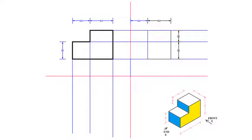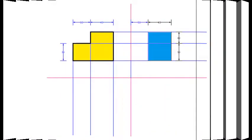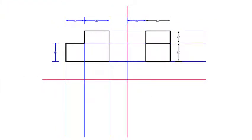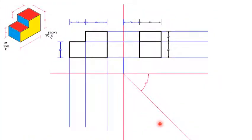We move on to the plan. To draw the plan, we shall need a deflection line of 45 degrees, so that all the projection lines hitting that deflection line will be deflected at 90 degrees and therefore transfer the measurements we have here. Draw that 45-degree line and project these lines to hit that deflection line so that they are deflected, and that will give us the plan.